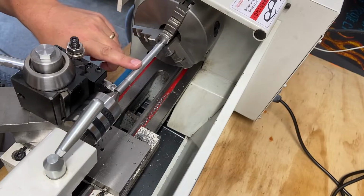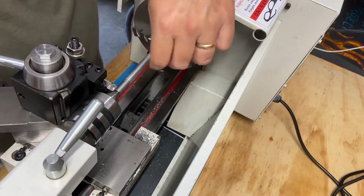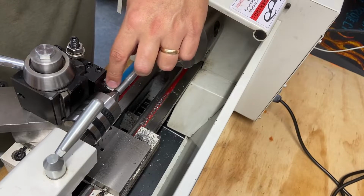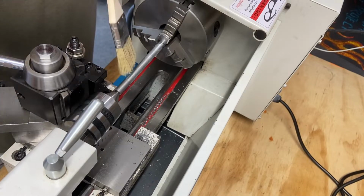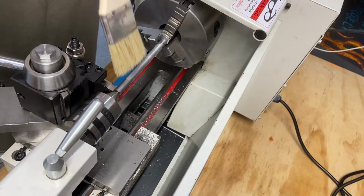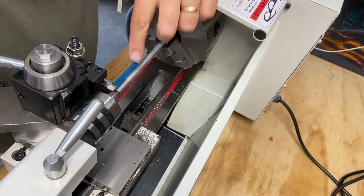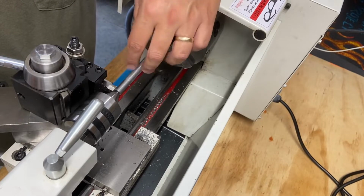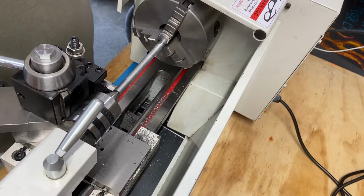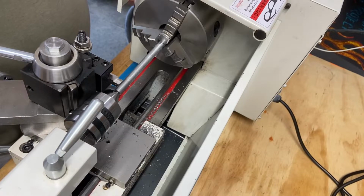Looks, that's a little rougher. So whatever this material is, it doesn't like the faster cut. I suppose my high speed steel could be getting dull, but I don't think so. This needs slow. The slower the better for whatever this rod is. I'm gonna go back for one more pass, try to clean it, make it smooth again. And we'll go a little bit slower.